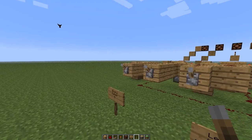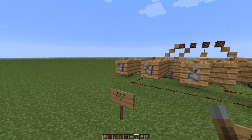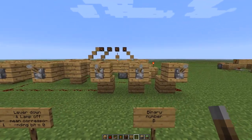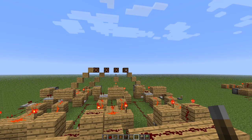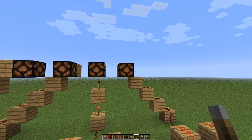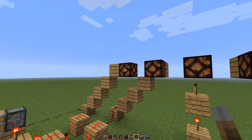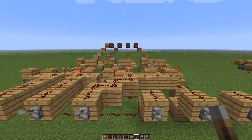So that's the three bits for A that you can set with the levers. Lever up equals 0 for that bit, lever down equals 1. So that's your number A and your number B. You've got your display — if that's on, your LSB, your least significant bit is going to be 1; if it's off, 0. That's the second bit, third bit, and then a carry bit for the carry.